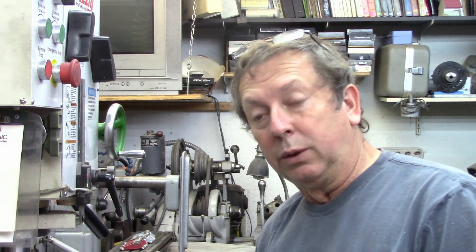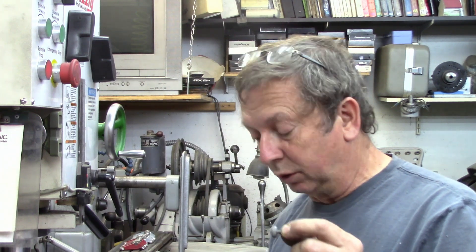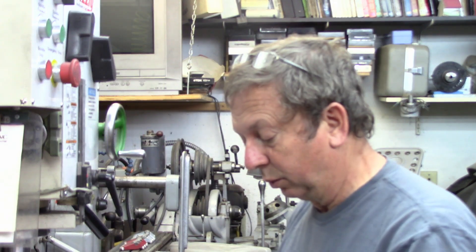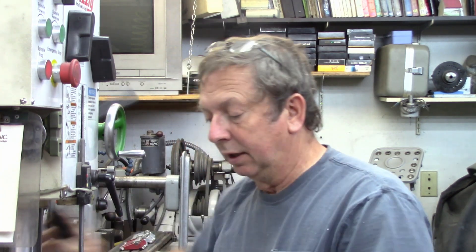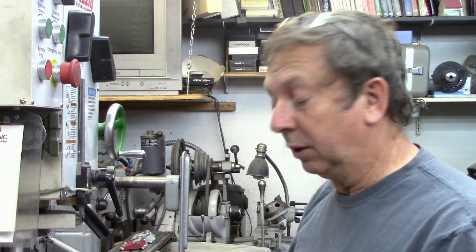Where I run a digital readout it's not really necessary for me to even have the nut on the scale. I think if I were to shorten this little knob up to where there's less engagement and it sits closer, there's probably clearance for it underneath there and you'd still get full travel. I'm going to look at this limit switch and decide whether it's worth giving up that travel for it — it's a nice safety feature, but eight and an eighth inches with it on there is still good. More travel is always better as far as I'm concerned.